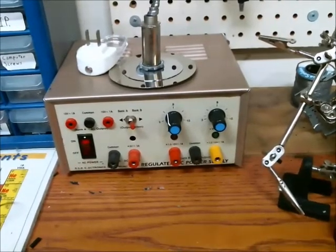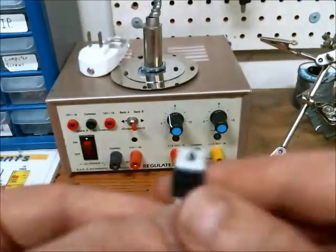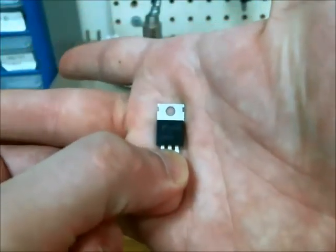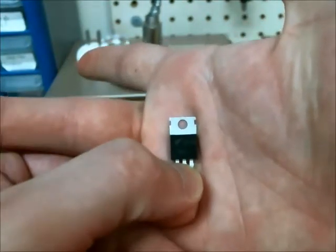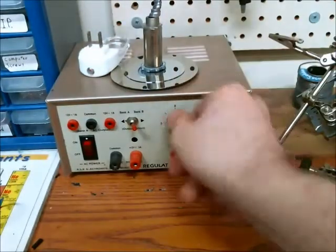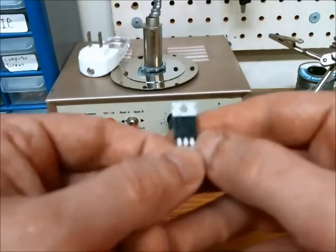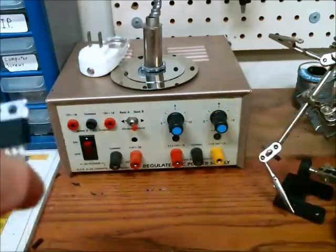So I'm going to build one so I can place it on the output here. What I'm going to use to build that is this LM317. It's typically used as an adjustable voltage regulator — it's exactly the same thing that's in the back of this power supply to control the voltage output on this knob. I'm going to use it in a different configuration to regulate current, and I'm going to show you how you can do that.